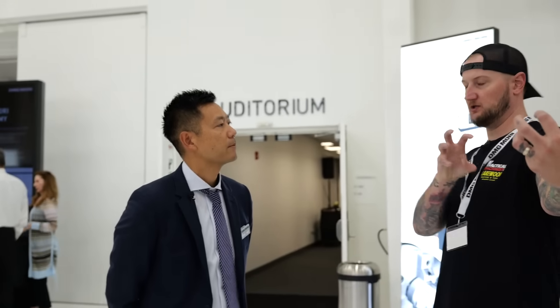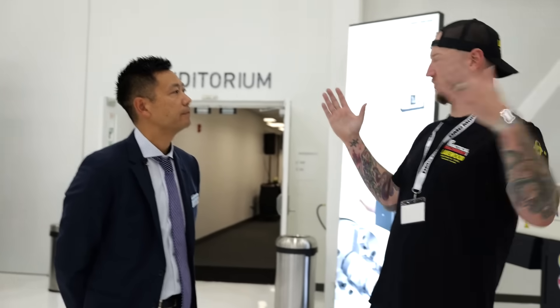I did look at the sign behind us — this machine can have a four-inch bore. Is that standard? It is an option depending on how you spec your machine, but you can have a through-hole on your left spindle and your right spindle as well — you can have a four-inch bore on either side if you want. So if you need to take a large diameter shaft, pass it through the right spindle and machine it, you can. You can literally have a four-inch shaft go all the way through and pass it to the other side.